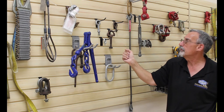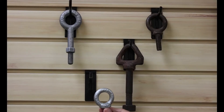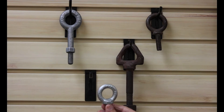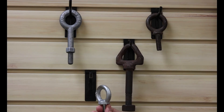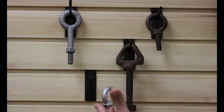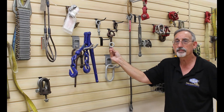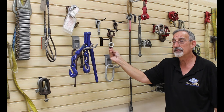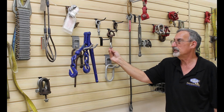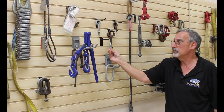We're also looking at proper installation. We are permitted to put a washer or spacer underneath an eye bolt to adjust the plane of the eye bolt. When installed, the line or plane of that eye bolt has to face the center of gravity of the load. If I'm pulling against the plane of the eye bolt, then I have no known capacities. A washer or spacer will allow us to adjust the installation so we're facing the pull.